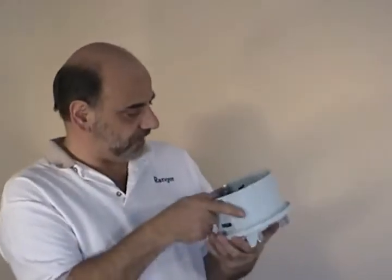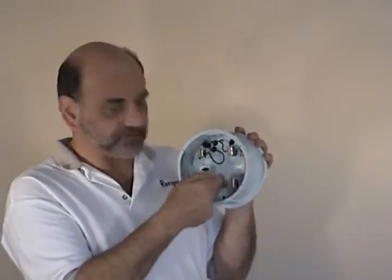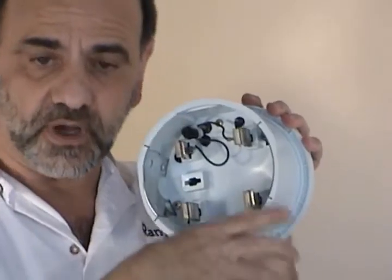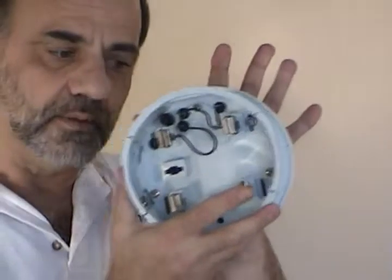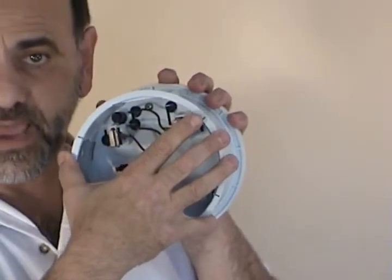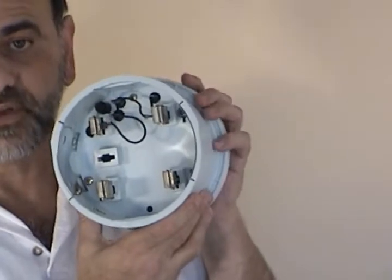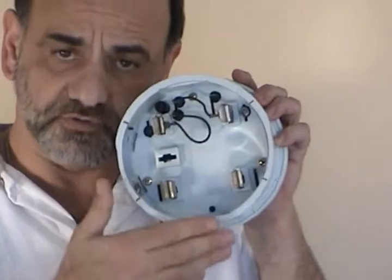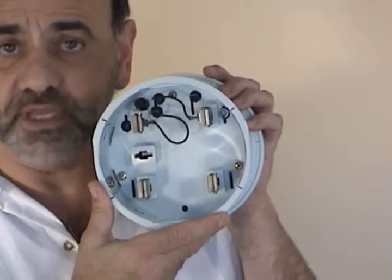The meter socket logger itself would set in this orientation here. There will be a six o'clock position and a nine o'clock position. The power company will remove the meter off of the house, then place this unit in place and return the meter, and then it will automatically start logging. The unit will automatically start logging if it sees a voltage from L1 to neutral and doesn't see any current load — after 15 minutes it will begin to log anyway.